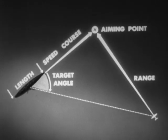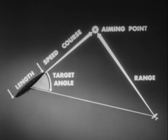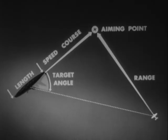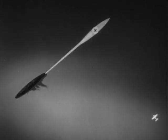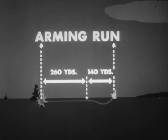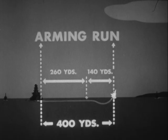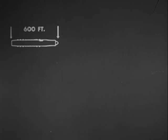The actual ship lengths to be allowed for are measured from the bow of the target vessel along the course line, extended to the aiming point, which is the center of the ship at the intended point of contact. Assuming an underwater run of 400 yards with a proven new torpedo speed of 32 knots, here is a thumb rule that can be applied against a 600-foot target on a steady course, wind force zero.